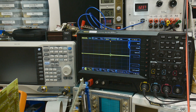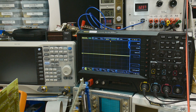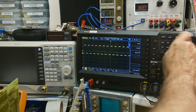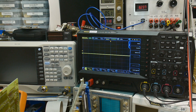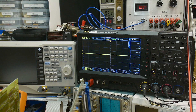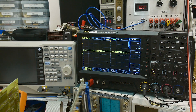Let's go to TP6 — I don't see anything at 6 either. Let me make sure my trigger is working — my trigger's not working. Let me get it into a state where it's working. There we go, maybe that'll help. Back to TP12 — I don't see anything on 12. Let's go to 6 — I don't see anything on 6, maybe a tiny little thing, but it's really super small, just leaking through something.